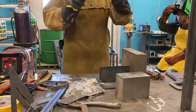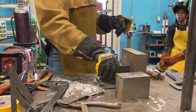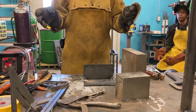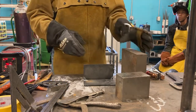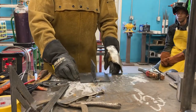Generally go like 1, 2, 3, like 3 seconds. You know, it doesn't have to be crazy here. I've got to make sure I can take this off. If somebody comes running through the door and says it's the wrong part, take that weld apart, you've got to be able to do it. You don't want to go, oh man, it's all welded out. You want to make sure you can reverse it. So, now I know I'm not dead perpendicular, I need to fix this thing.